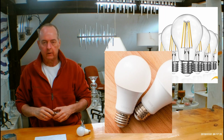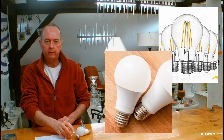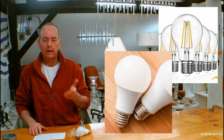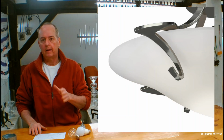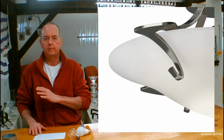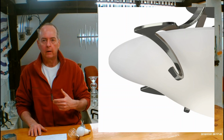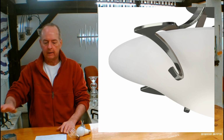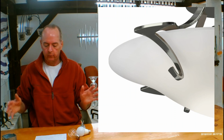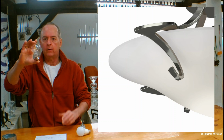And the light coming out of this is going to be offered to you in all kinds of different ways as far as the color of the light goes, and we talk about that in every video. 2700 Kelvin, super yellow like the setting sun. They're also going to offer these bulbs to you in something called daylight, which sounds like it should be like sunlight and warm, but it's not. Daylight is going to be 4,000 and 5,000 Kelvin on that Kelvin scale. It's also a bluish white light like an overcast day or like a convenience store. Just kind of keep an eye out for that. Now, what we like to use in our showroom, we mention it all the time, is warm white, soft white. And that's a nice light coming down on this table. So this is a warm white, soft white, 3,000 Kelvin LED that's right above me, casting all this really nice light. So we like to use that. My take would be to go for a 100 watt equivalent if I could, at least a 75 watt equivalent. Easy to find.